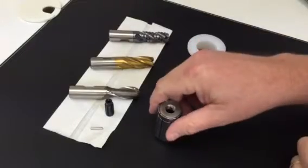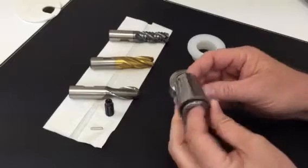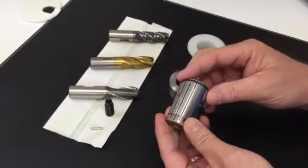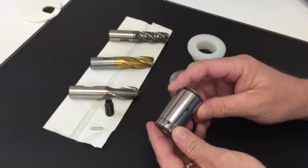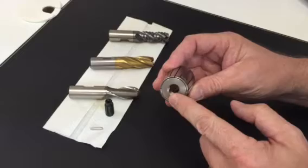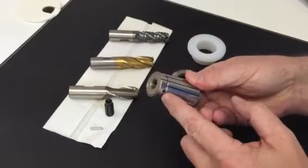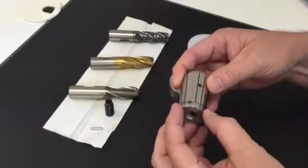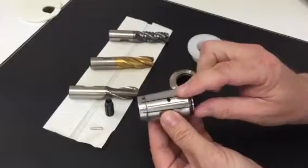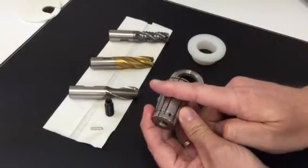We have developed a non-pullout SX-25 collet. This is a one-inch system. Here I have a three-quarter setup, and what we've done is two things to the collet. We've added this disc in the back that has an M12 thread — it's pinned in. All SX collets have this counter bore in the back so we can put this disc in, and we EDM'd this cross hole here for the drive pin.